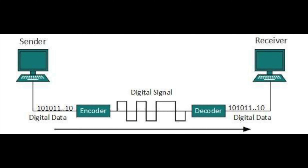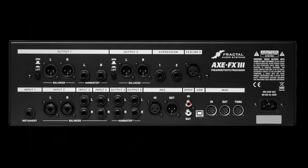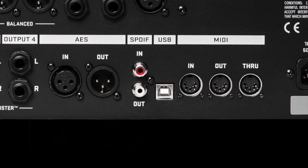Okay, now that we have the technical jargon out of the way, let's just say that SPDIF allows you to keep your signal in the digital format all the way to your recording software. It doesn't get converted to analog and then converted back to digital, so there's less chance of any signal degradation. But why not just use USB? It's basically the same principle — the data from the modeler stays in the digital format all the way to your recording software.